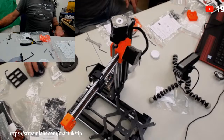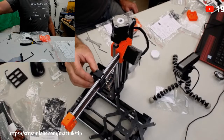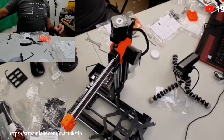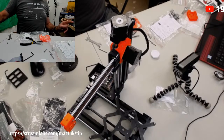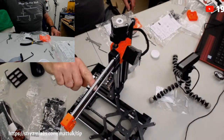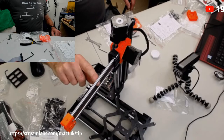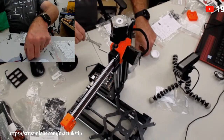Because I'm sweating cobs. Right, X-axis belt tensioning. Move the X-carriage all the way to the inside edge. So we're going to go like that. Using a finger on your left hand, push the belt down in the center of the X-axis. Some force should be needed for you to bend the belt, but don't try to overstretch the belt as you might damage the printer. I'm supposed to get your finger in there. That's floppy. Adjust it by releasing or tightening both screws at the X end. I would have said that needs some tension on it.